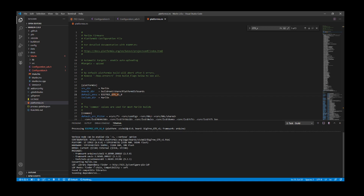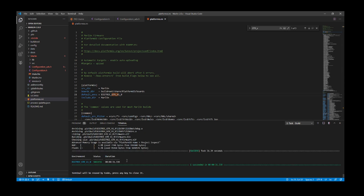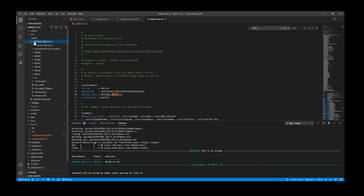The build may take a few seconds and it may fail on occasion. If you think it's correct, rebuild again and see if it works. If not, go to the first error you encounter and that'll give you a description of what's occurring. I also have a Discord in the description of this video — it'll allow you to communicate with myself or somebody else there who is willing to answer questions. Now that the build is done, we need to go over to .pio, then build, then the BigTreeTech folder, and reveal in explorer.